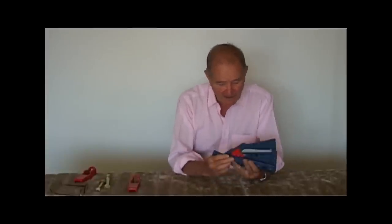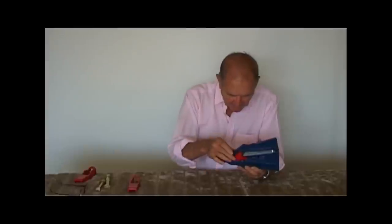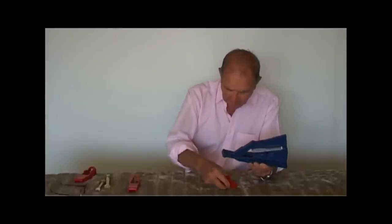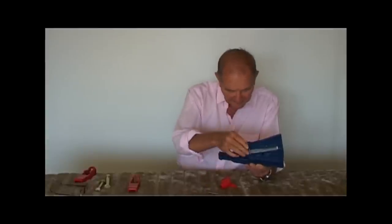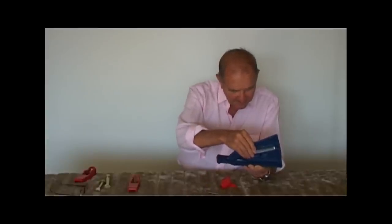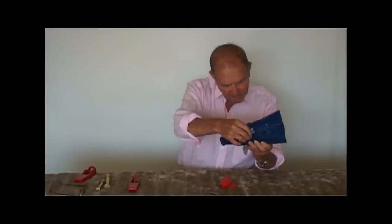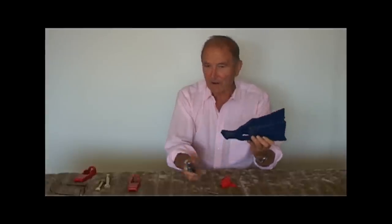These two parts are easily replaceable. I'll show you how they come apart. The rabbit goes back into its hole like that, drops out like that, and when it does, the little pin — the wand we call that — also comes out. Then the top hat slips forward, unhooks like that, slides down through the hole, you get a slight half twist, and the whole thing comes apart.